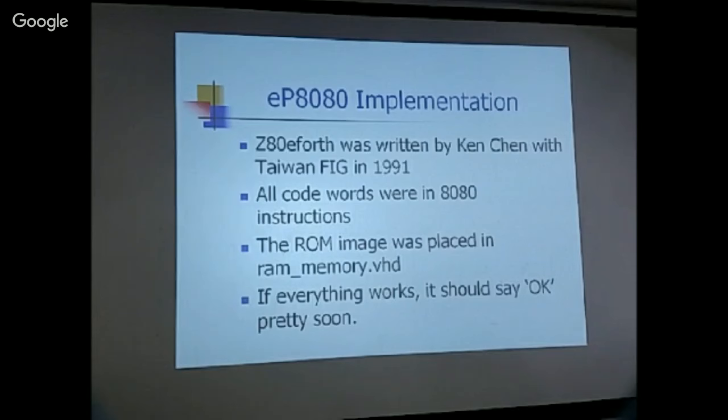And finally I found that there is a box in the memory synthesizer. It allows you to choose big endian, little endian, small endian, and none. So I tried the big endian, doesn't work. Tried the small endian, doesn't work, and tried none. None looks awful because it just breaks down all the individual bits in the address lines. The 16 address lines you have to specify each one, and the 8 data lines you have to specify each one. So the VHDL code looks ugly. But that worked. Okay, so I was very happy there.